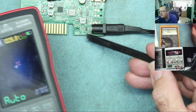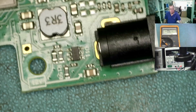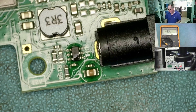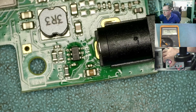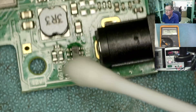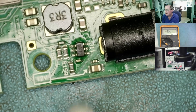Another good way to prove this if you don't have the thermal camera: take a little bit of isopropyl alcohol, put it on the area, plug this in, and see where it evaporates fastest. Well, you can see it's around these capacitors — that went first. I'll switch it back on again; you can see there's liquid still around the chip. One of these capacitors is definitely sizzling away.